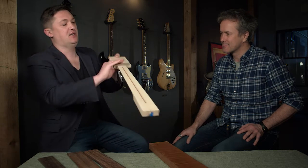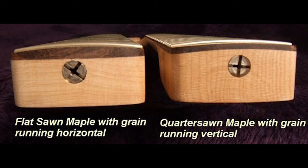I have heard of it and I've got no idea what it means. Well, it's quite a fancy word, but I'll make it simple. Essentially what it is — if you're looking at the grain of the neck, the grain is generally nice straight lines — it's about determining how the wood was cut. It's not a different type of wood or species, it's a different cut of wood. And specifically, looking at the end grain of the piece of wood, you can see that the winter growth lines are vertical — 90 degrees to the plane of the surface.